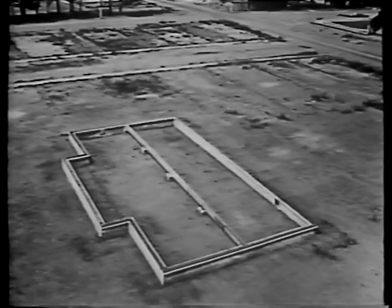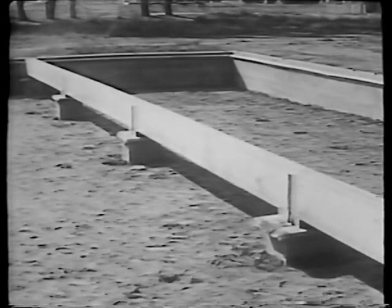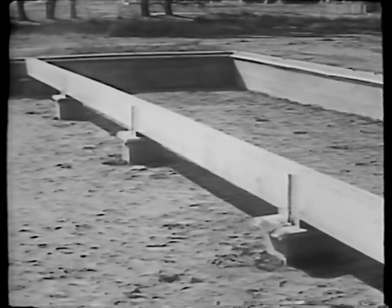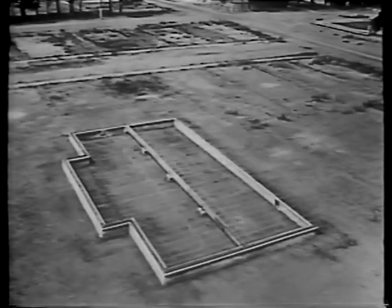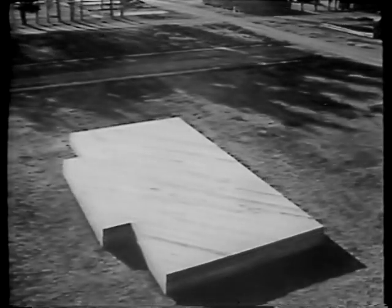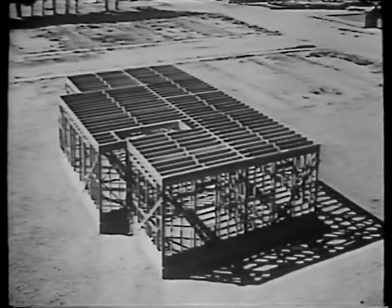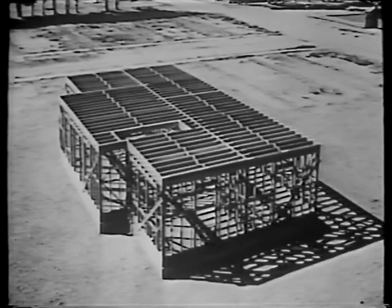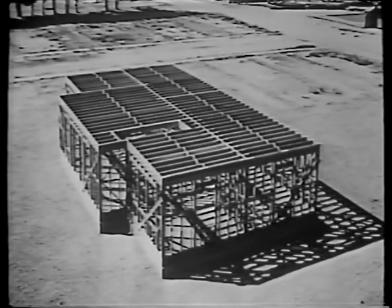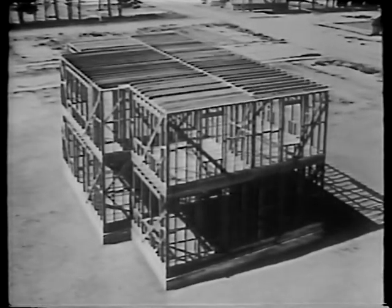This is the foundation on which we are going to erect our Samma Permanent Administration Building. It consists of a concrete foundation wall with redwood sills and concrete piers supporting a wooden girder. In this film, we will add the floor joists, the subflooring, and the walls of our building. The framing methods and details shown will generally apply to all frame buildings, but may be altered to fit varying conditions. We will erect our building to its specified height of two stories.